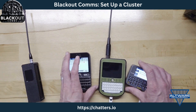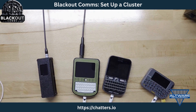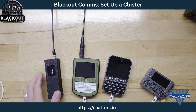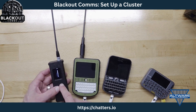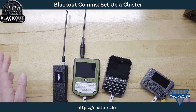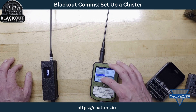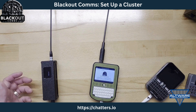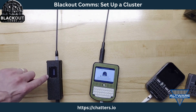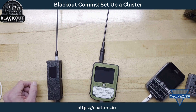Lastly, the node. I go ahead and onboard that — it will run 24/7 so I plug it in as well. When I plug it in it starts up and displays 'onboard connecting' on frequency 911.1 MHz, waiting to be onboarded. On the root I choose onboard. Notice I didn't have to do any setup on this device — I just installed the firmware, put an SD card in, and turned it on. It's ready to join. I can see all the steps as it exchanges trust information and frequencies.